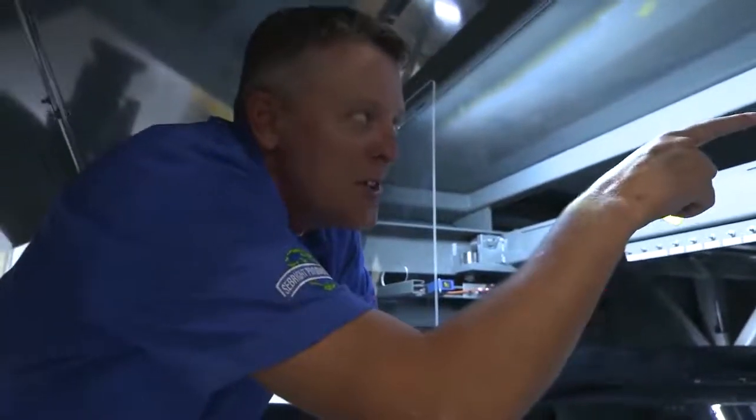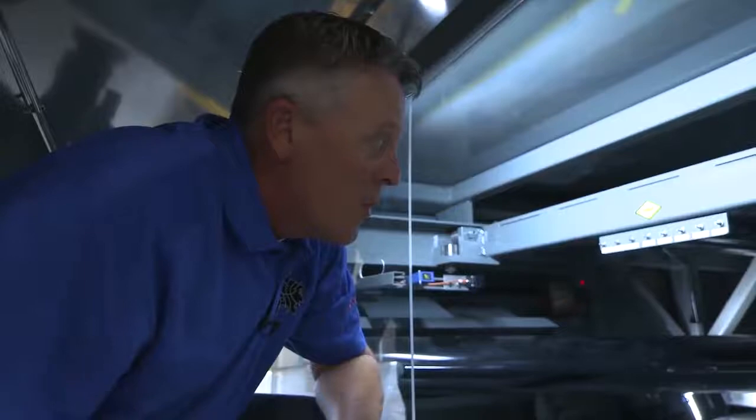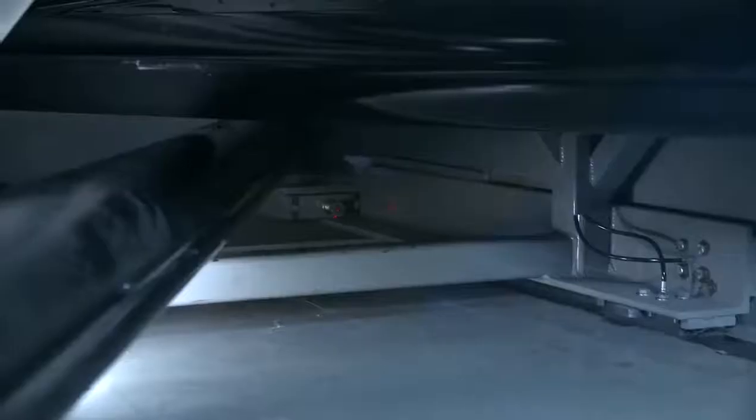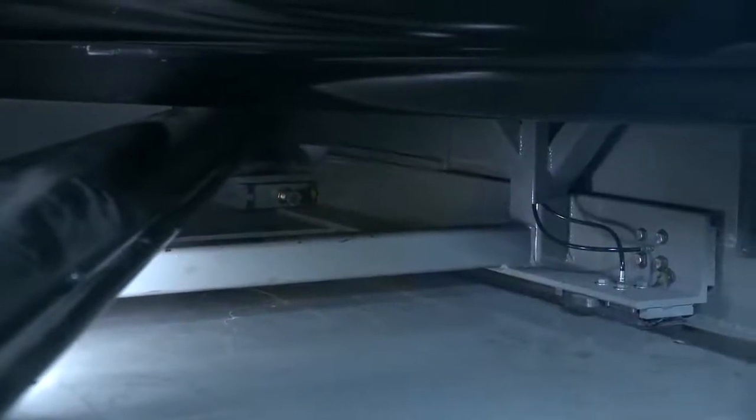The tail rollers on the backside of the ram — not only do we guide the system from the front, we guide it from the back as well. The last piece is the pack shoe adjuster — it's shimless. You can see the back jack bolt: you turn that and it will raise and lower the height of the ram without having to take the machine apart.